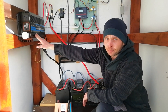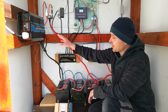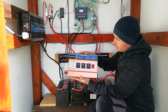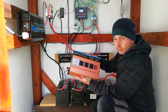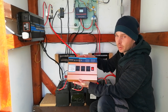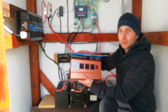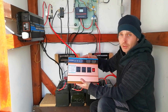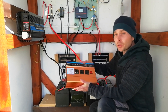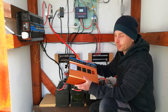Over here we have the inverter. Inverters are something I've really had a couple of tough lessons with. We started off with this little unit here — I think it was about 200 euros. It ran quite well for about two months until I noticed one day that the fans weren't working anymore. Inside these they have little cooling fans to keep everything cool and stop them overheating. I noticed one day the fans weren't running — luckily I caught it in time, because that would have caused a fire.